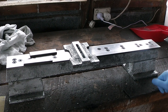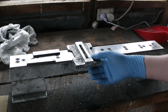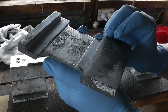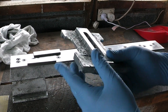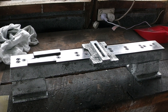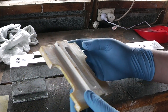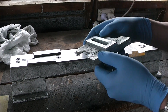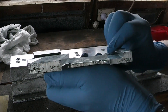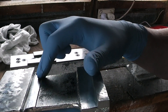Very quick status update. I got the bed finished and I also did the casting for the cross slide here. I have made some progress on scraping it in on both the top and the bottom, but I am not happy with this. There is a visible bow in the casting here, and that is because the original pattern that I used for it — this pattern in fact — has a visible bow in it from where it didn't 3D print properly.